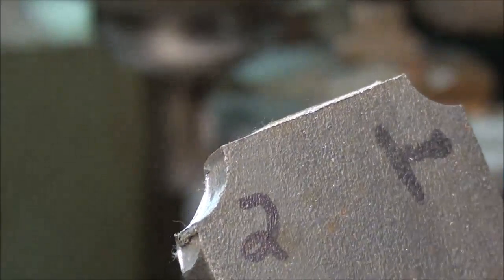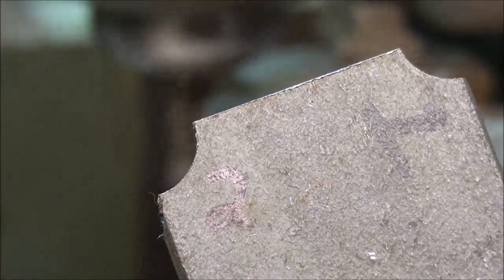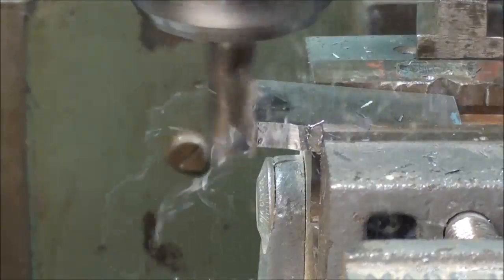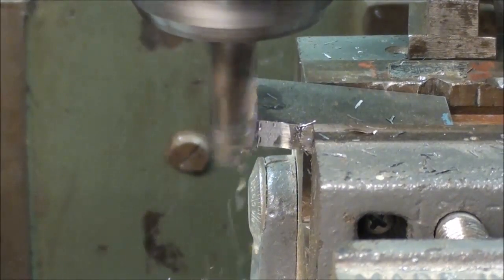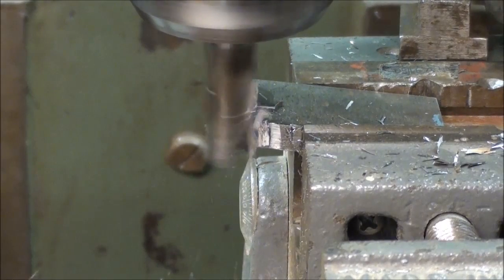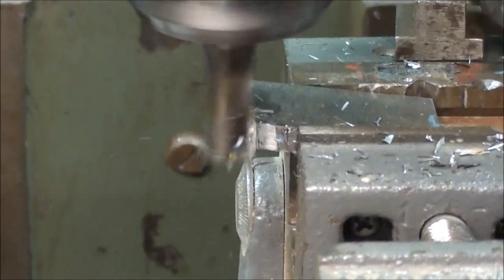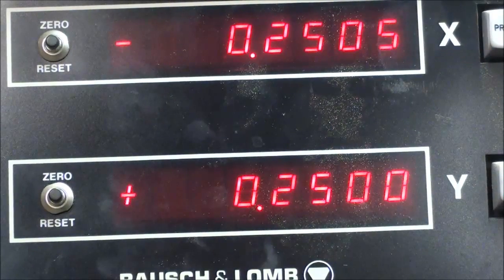Now that I know where the edges are I'm going to mill out or notch that corner to create the radius. I'm going to move in 250 thousandths on the X and 250 thousandths on the Y. I put a little oil on it while doing that and then it's completed. I'm watching the digital readout more closely than I'm watching the work. This is tool steel so it's fairly hard compared to mild steel even in its softened state. There's a look at the digital readout — I've moved in 250 thousandths in each direction, and I'm a half-thousandth over, but that couldn't matter less.